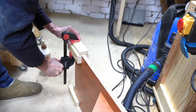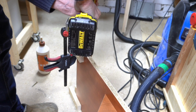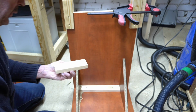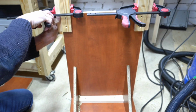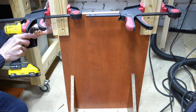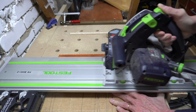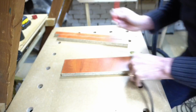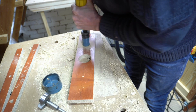The side pieces were glued and then just screwed at the bottom end. And to finalise the front panel I needed another 3 pieces of melamine faced chipboard. One cut 80mm wide and the other 2 about 25mm. The sharp corners were removed and the 2 smaller pieces each had 3 drill holes for screwing to the front face. Now the larger piece needed 2 holes in.